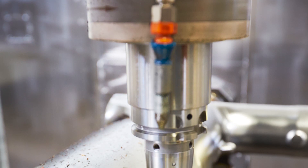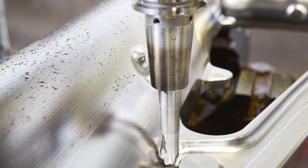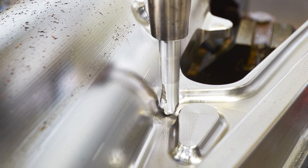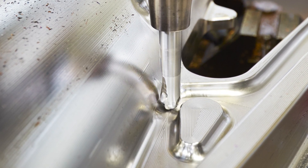Cutting performance and surface finish is quite crucial for these types of landing gear projects. The great thing with the FOGS gantry solution is it's a RAM-type system. We can automatically change the five-axis BC heads onto the machine's RAM, then change the spindles into the heads, and change the tools into the spindles — all automatically. This means we can drive very large tools with high power torque for roughing, up to 100 kilowatts on gear spindles, and then exchange the spindles and run very small tools at high speed — motor spindles at say 24,000 RPM for finishing. This gives the customer a completely optimized automated process.